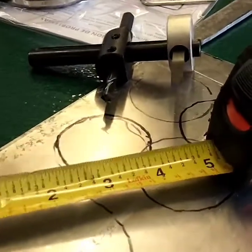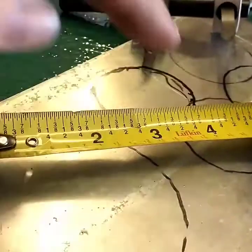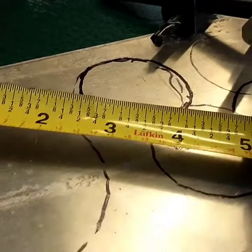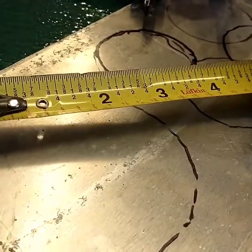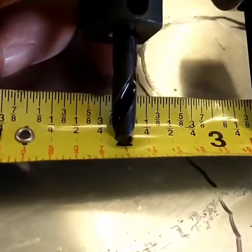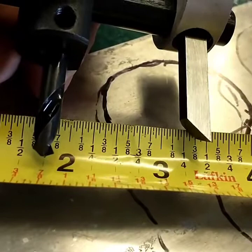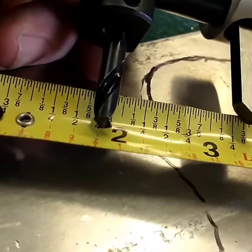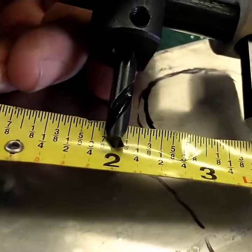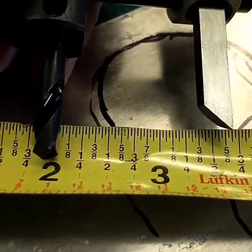The first question people are going to ask: how do you set it up? You need to measure your circle that you're going to cut. In this case mine is three and five-sixteenths. Half of three inches is one and a half inches. I put it on two because that's an easy number to start from, go out an inch and a half, and then half of five-sixteenths is five thirty-seconds. From the half I count over five ticks — one, two, three, four, five — and the center of the point should land at the mark. There we go.